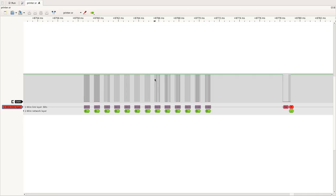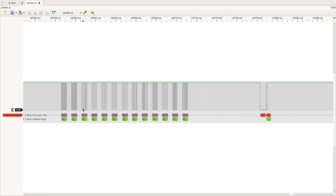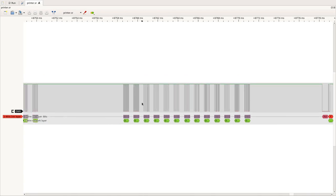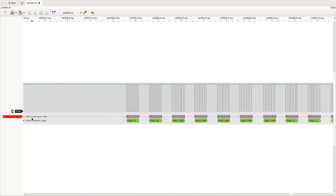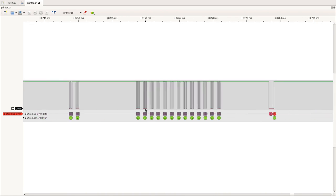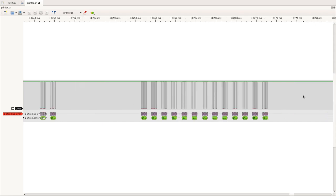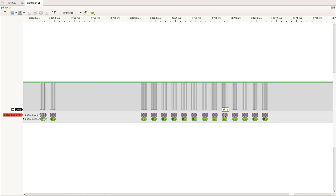I already mentioned that PulseView uses the libsigrokdecode library to have these protocol decoders, and so the results we can see. But this project is open source, which is quite neat, because what it allows you to do is to understand how it works. And when I started the project, the one-wire link layer decoder wasn't working quite right for my setup or for my traces. It might work right for other traces, but for my traces there were some decoding errors. So I understood what the error is, and I actually re-implemented the one-wire link layer decoder so it decodes everything properly. For that I just needed the datasheet of this protocol, and now it works pretty well for my trace, and it also works nicely for the previous trace, which was in the existing one, because there are also example dumps.